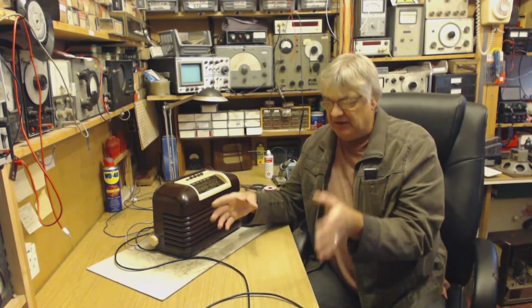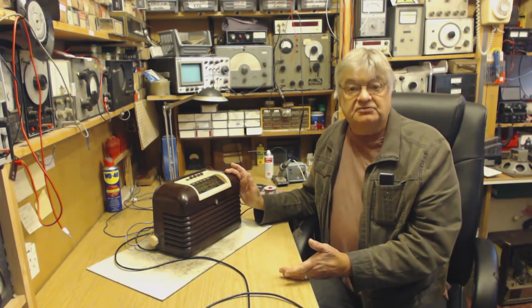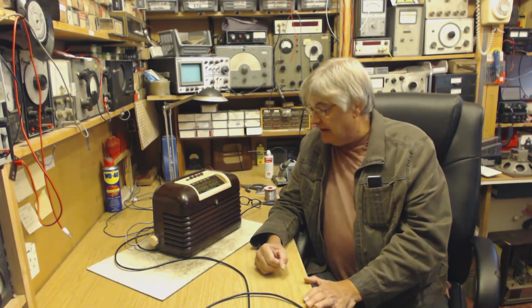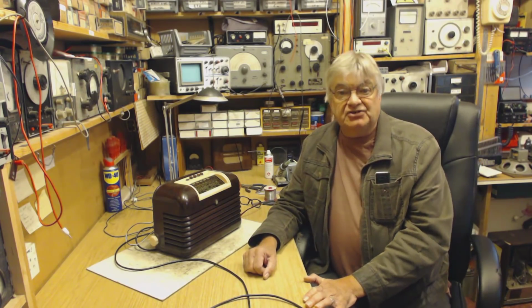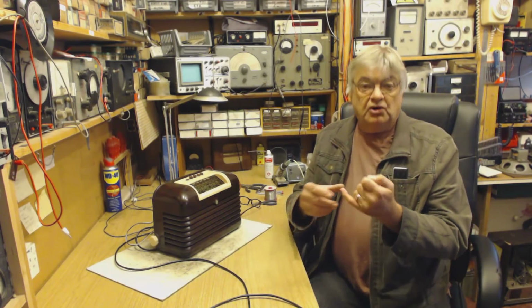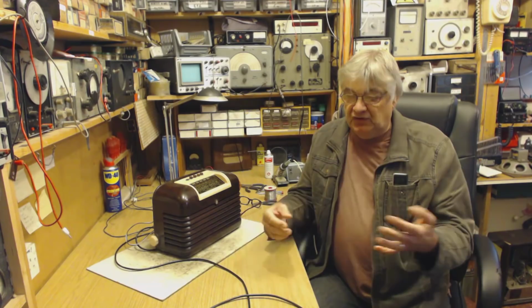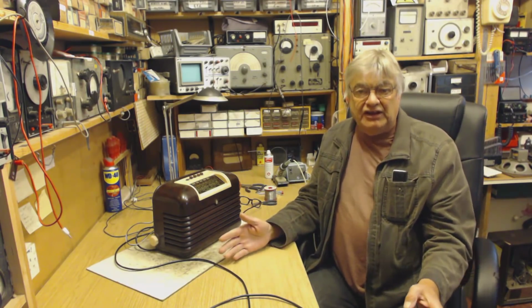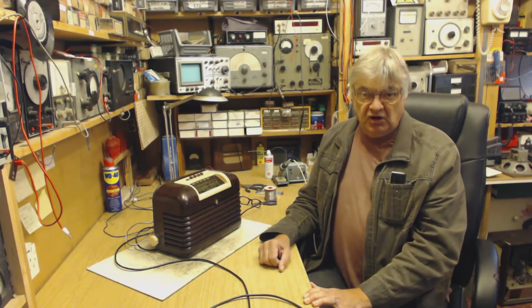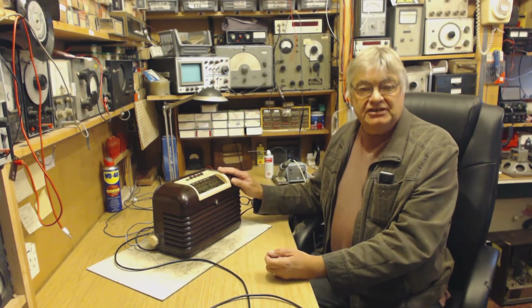I mean, I'm exaggerating now. Your chassis is kind of blasting out interference everywhere. Of course your radio's picking it up because the radio's built on the chassis. How closer could you get? To make matters worse, connected to your grounded Marconi aerial is your washing machine earth, your dishwasher, your tumble dryer, your freezer, your fridge, everything that's earthed in the house with thermostats and motors going click click and whir whir, buzz buzz and whatever. It's all coming up your earth wire to your chassis.